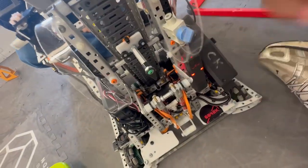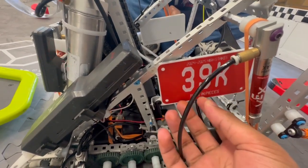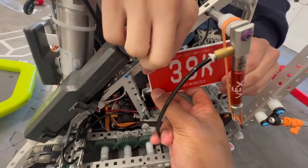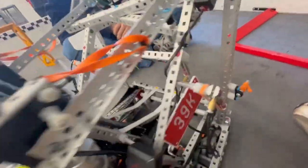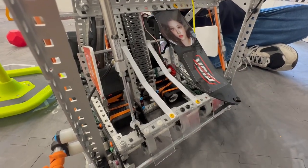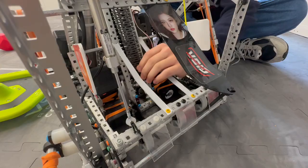We use plastic collars here and here to save weight. We have these custom 3D-printed license plates — I know these are not legal anymore, but the nice thing is we won't be losing license plates because we can just flip it over and switch colors, so we never have to scramble to grab them. Also, these pieces press the ring against the second stage. A lot of teams have shorter second stages so the ring falling out isn't an issue, but we have such a long stage that these really help with intake consistency.